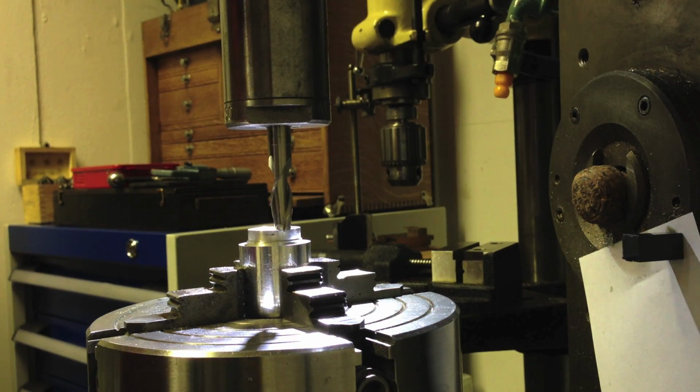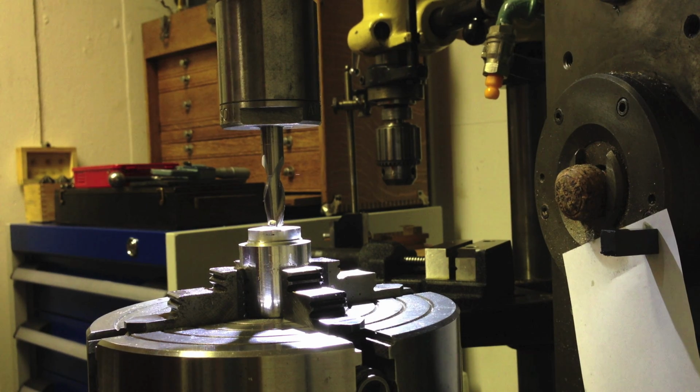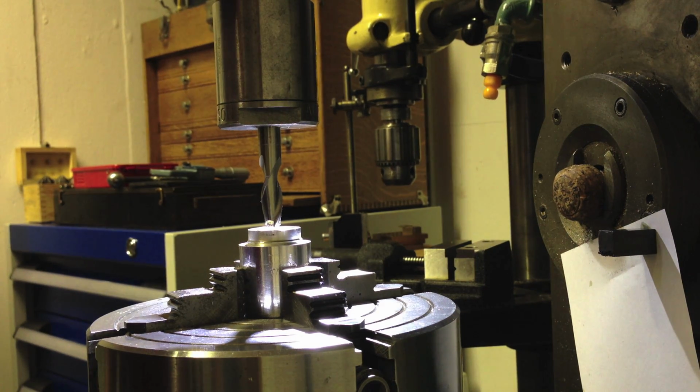I don't think I need to go to very great lengths to find the precise edge, as long as I mill reasonably along a diameter, I should be fine. In fact, what I can do is just roughly center this over the center hole. Oh, blasted! I've moved in the wrong direction. Too many handles. I'll just zero this micrometer dial on the Y feed.